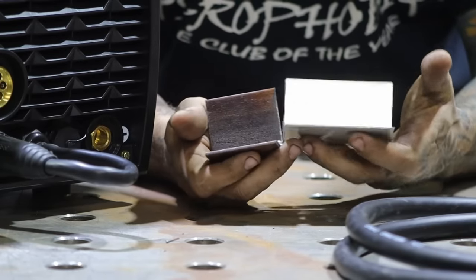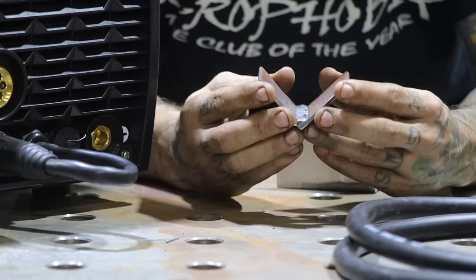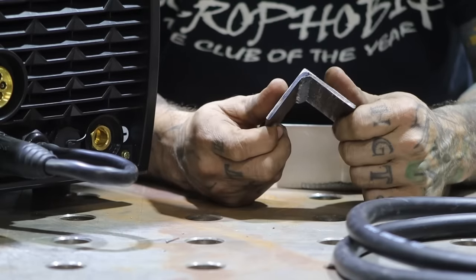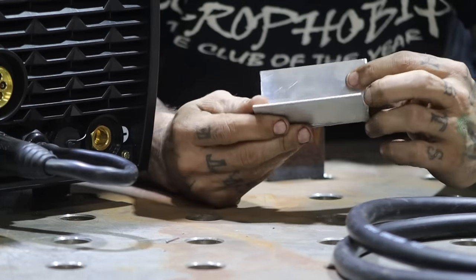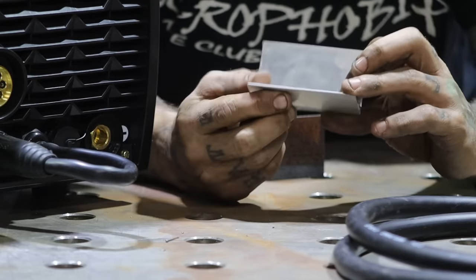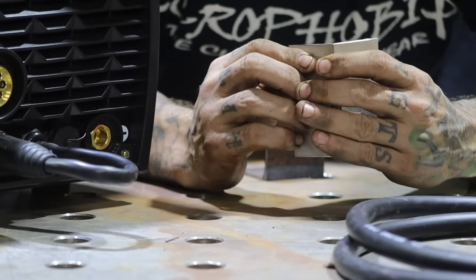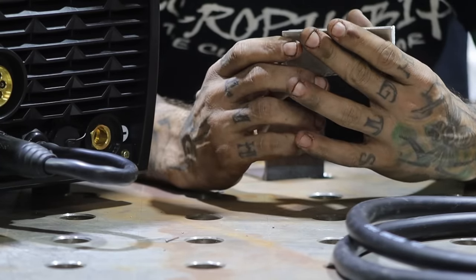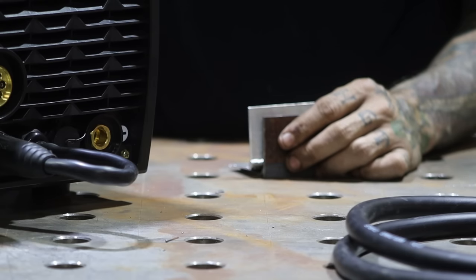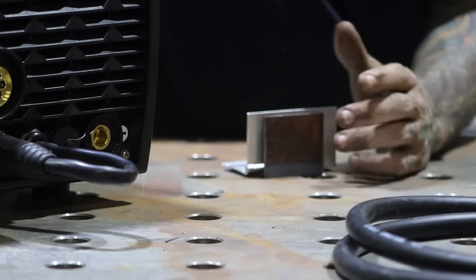The welds actually welded really well for what it is. For 500 bucks, it'll do what you need around your shop as long as it's nothing industrial and heavy duty. It made nice beads once you figured out the settings, and it's got plenty of fusion. The aluminum looks good — I was running a little hot. I had it set for 035 wire and I only had 030 for the aluminum, so it took me a little bit to dial it in and I didn't get it quite right, but it fused — there's no lack of fusion. It's strong. For the price point of 500 bucks, it's not a bad little welder. Don't be too deterred to buy it if you're looking at one.